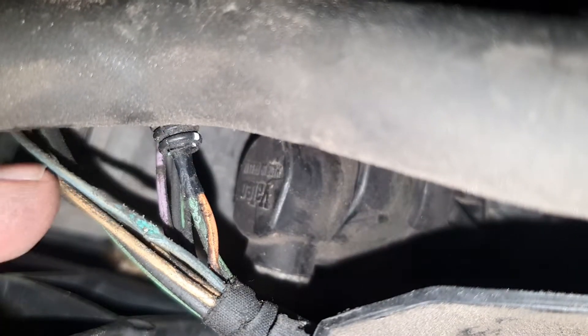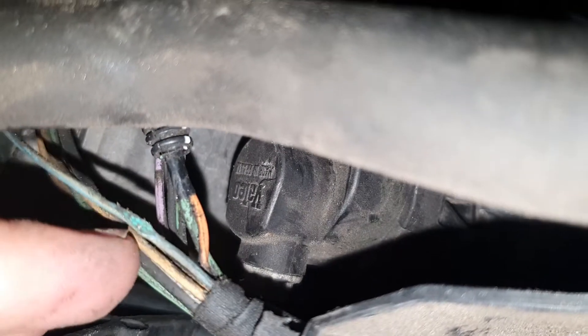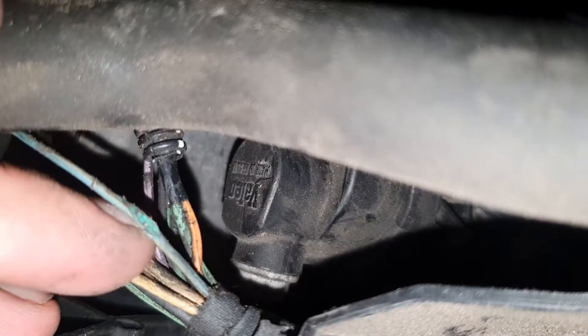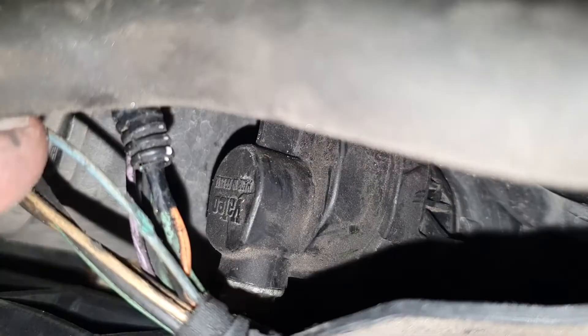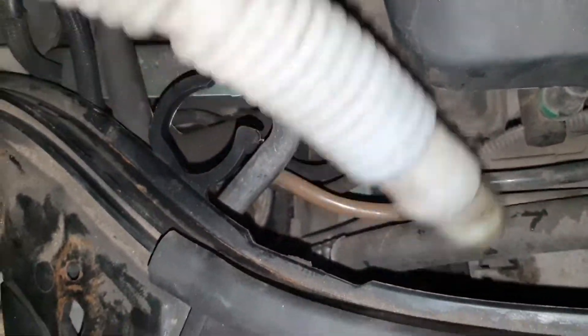I'm not sure if it is the correct wire, but it definitely should not look like that. Let's strip this a little bit and try to figure it out — it's definitely broken. That's just unbelievable for a fine cable like that. Probably it was corroded because this line goes through an area where there was some movement and water, which did some damage to this cable.